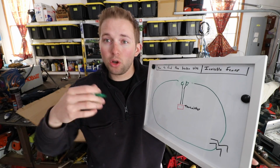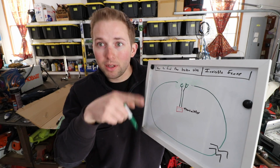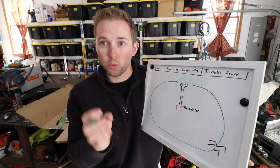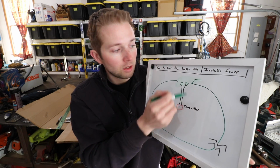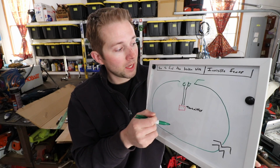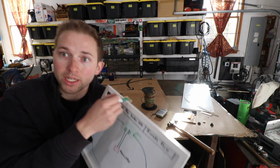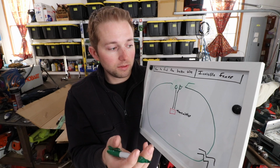Well, we're going to take our lawnmower out to where this junction point is. We're going to wrap a wire around the ignition coil of the lawnmower with the lawnmower running. We're going to strip the other end of the wire, and that stripped end is going to connect to one leg of our loop. Then we're going to take that AM battery operated radio and tune it to the frequency that that ignition coil is throwing off.